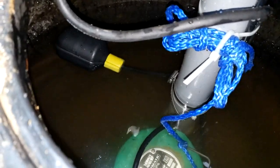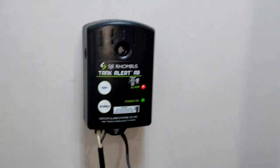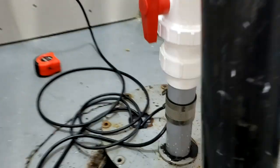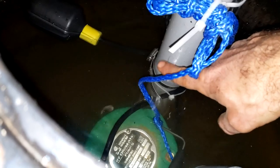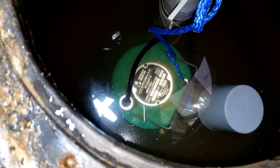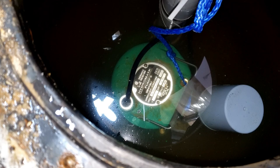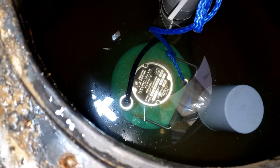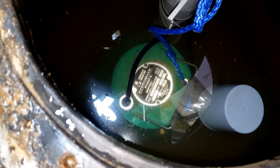And there you have it! If you cannot hear me, that is a good sign — that means the float alarm is working. We can just silence that. Our float alarm is successful — that is a good level for what we need. Now we'll proceed to tighten that. It's just a matter of plugging in the pump now. Plugging in the sewage ejector for the first time — we've already confirmed that the float alarm works. The pump is well submerged and that float switch is fully upside down. We made sure all our unions are tightened, all our connections are tight, everything is glued. Looks good. It will turn off once the float switch has returned to vertical facing down. And I think that's a success!